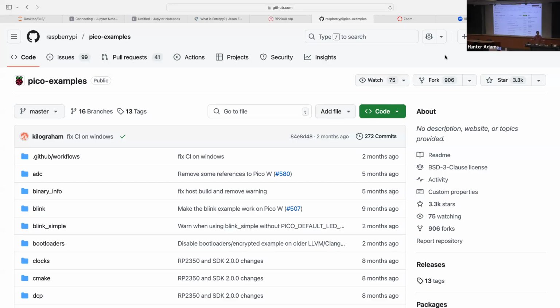That's a pretty handy capability to have, particularly if, for instance, you're making a little wearable watch as a final project out of a Pico W, as I know one group is. You can connect your Pico W-based watch to a network. It'll send off a UDP packet to a network time protocol server. That server will respond with the time, and you can update the time on your watch to the absolutely correct time, to within a millisecond or so, just by connecting to the network. I can imagine a pretty interesting arrangement where perhaps occasionally the Pico W just looks for your phone's hotspot network, and if it finds it, it connects, updates its time, and then goes off again, stops trying to connect. So if you wanted to make sure the time on your watch was correct, you would just turn on your hotspot. It'd be kind of interesting.